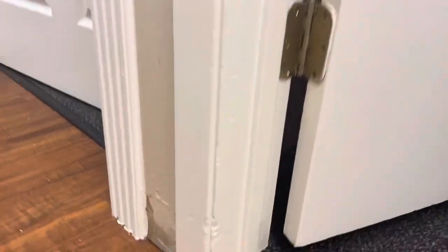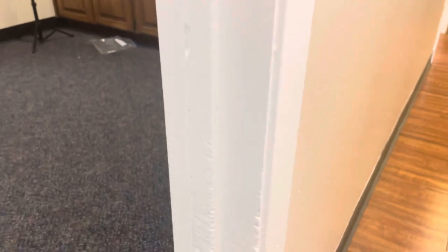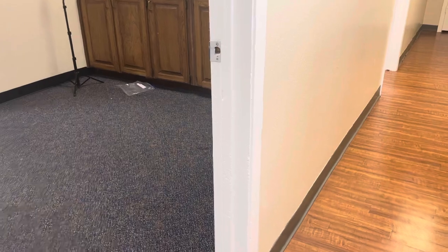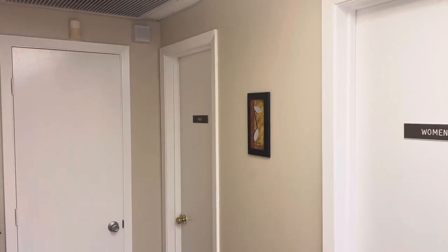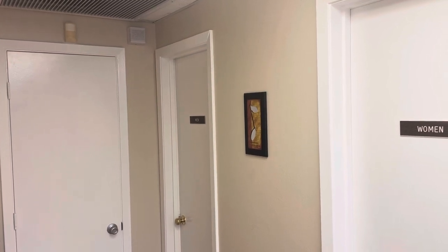I know some of these areas look really rough — it's because they are really rough. But I personally sanded them out thoroughly. So other than floating them with wood putty and all of that, that's been sanded very well. And the white is just a pure white: two ounces of white tint per gallon of oil-based enamel semi-gloss paint.